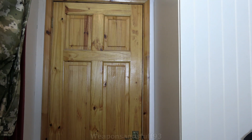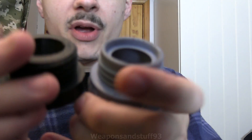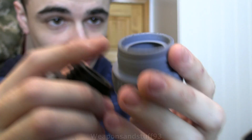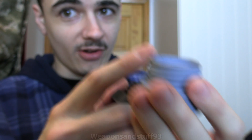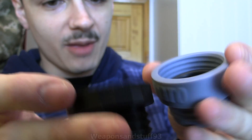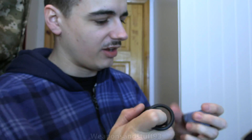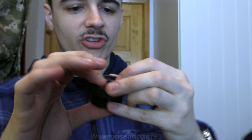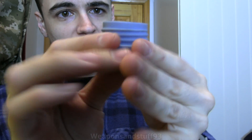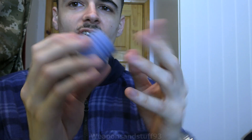If I compare it to that other one - you might be able to see by looking at the quality of the plastic that it's a lot better made. Firstly, it's got a longer screw thread than the other one, and it's got this bit that is designed to push up against the o-ring in a GOST mask and make a good fit that way. Also, you'll notice a much longer NATO screw bit on this side compared to the other type, and it has proper room for an o-ring to sit. If we put this o-ring into the other one, notice that we've basically got no screw thread left. That's why this one obviously works quite well - he's designed it knowing how threads work in masks: a decent intake thread, a decent o-ring, and a bit of extra space to push against the GOST mask washer.